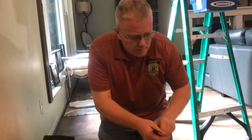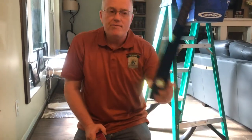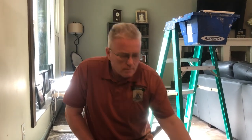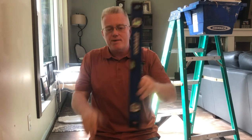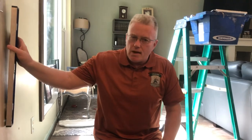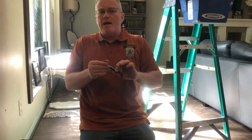You can clip this onto your belt. When you're over a doorway and don't have the length of a full level to determine whether your paper is plumb, you resort to these smaller levels over doorways and closets. Whenever you can, use a longer level — that gives a better reading. This yellow 48-inch level is my second go-to, and that's the one you want to use when you're hanging eight-foot drops — put it right around the middle of the drop to see whether you're straight.